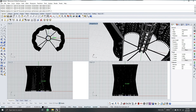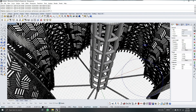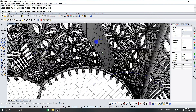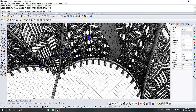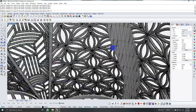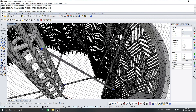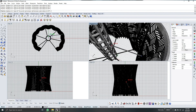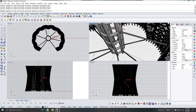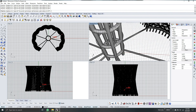We have the bottom part now supported. Next, I will connect other parts from the model to the middle pipe. I will not connect from this wire up to the middle because it will break the model, but you can use the solid area to connect to the middle part. If you see on the right viewport, if the angle is too bad for casting, I suggest you put it with the angle going down because it will help with casting. Check on the top view for which connection is shorter and better.